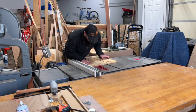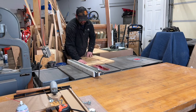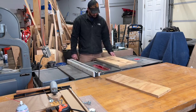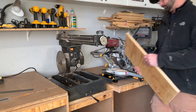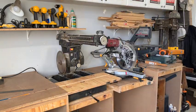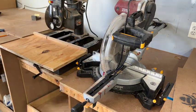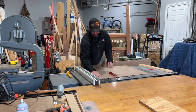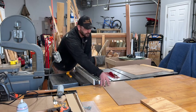Once again, we'll just head over to the table saw and cut it down to its final dimension. Now before moving forward, we're going to want to double check to make sure we had our measurement right. So just by putting the piece down and placing the old fence that we had previously, we can make sure that it's going to line up with that miter saw's fence. And as you can see, it does — so we're good to go. We can move on to cutting the top of that front piece and make sure it's accurate and fits directly on top.